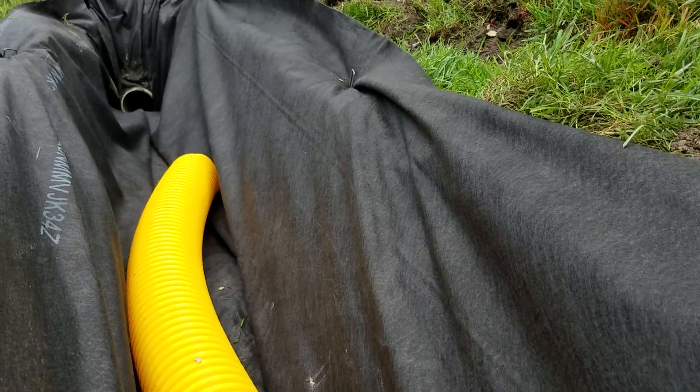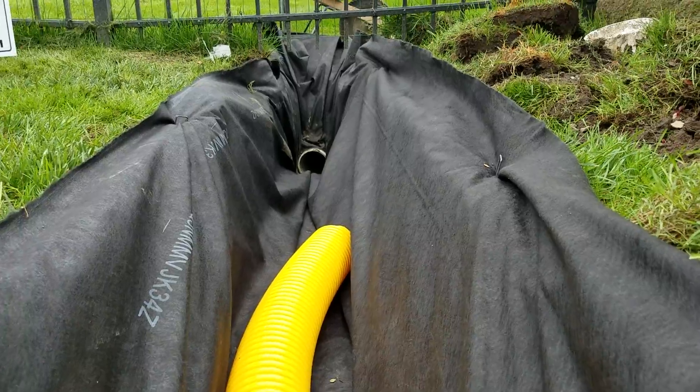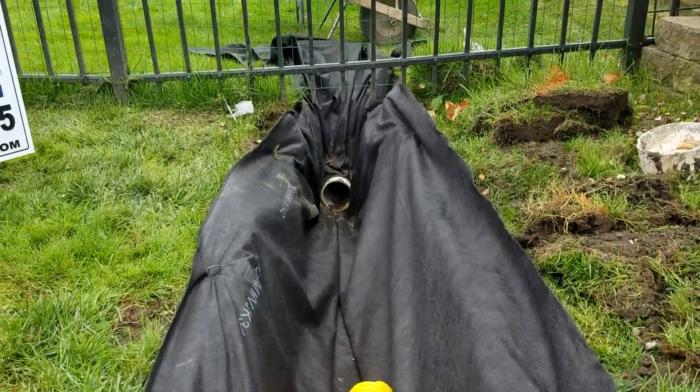Because of the non-woven geotextile fabric, we're not going to have it clogged, and we're not laying it on dirt. We're building our system fully contained. This system needs no maintenance — it's a wrapped system, it'll never get any contaminants in it because we're not going to put in any inlets or any drain catch basins.